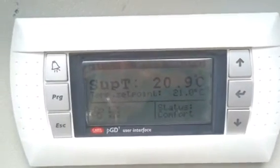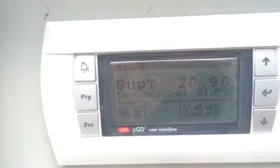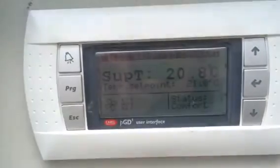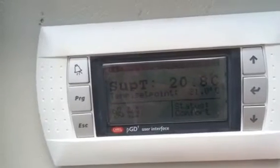I've been sitting here in front of this unit for about 45 minutes and I've seen it stably controlling on supply temperature, which is the tough one to control. The set point is 21 degrees and it's controlling stably to two decimals right below set point.